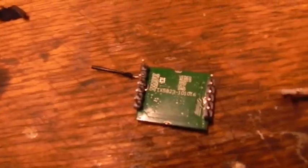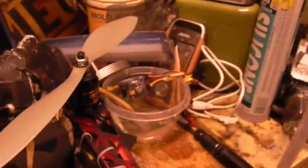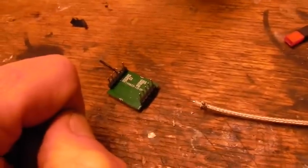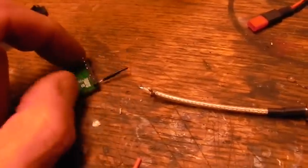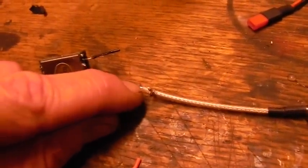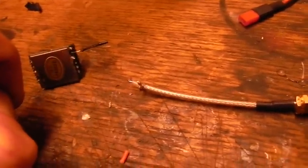I'm going to get to work on this, because this will be a backup transmitter — my third microtransmitter — and I still have that 12-volt one over there. But I wanted to try a fresh one and see if I can get a better signal range or a clearer picture, and see if the cleanliness of assembly plays a big part, and the gap between this small wire here, which is the antenna signal, and the wire that I'm joining plays a huge part in that. So we'll try this first and then see how the reception is.